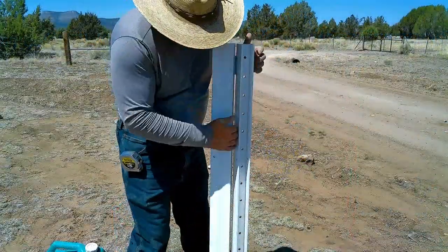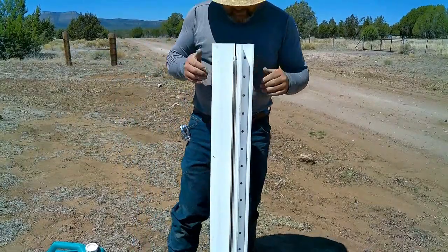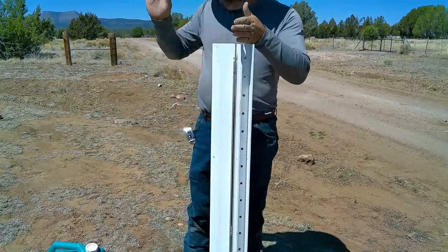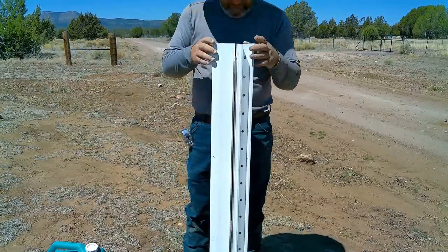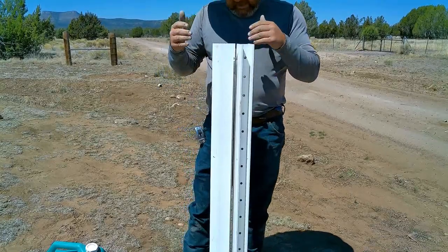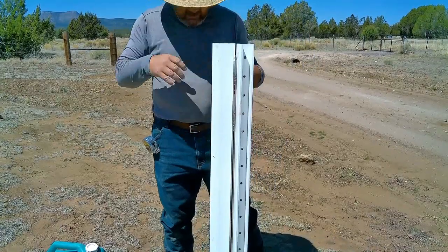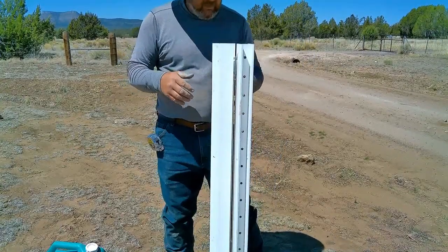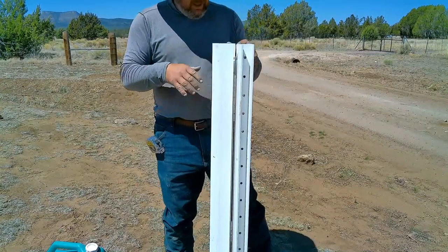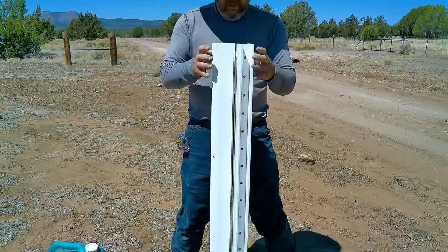As you can see, there's a gap here. The hinge — which I'll show you from the back side in a minute — these are our two lines: one's going this way, one's going this way, so it's not a 90. These hinges help keep it in place while we're setting the post. Once the concrete sets up, the bottom's not going to go anywhere. Once we run the wires through and tighten it off, it's going to be there. But the hinges help hold it in place — otherwise we'd have to sit here while somebody dumps in the concrete trying to hold it, and it'd be moving.